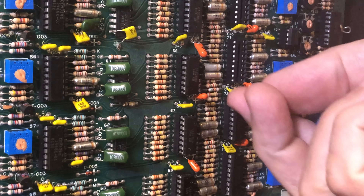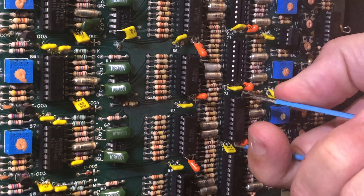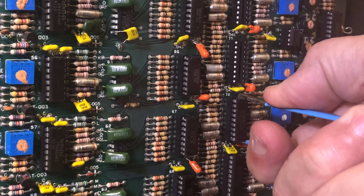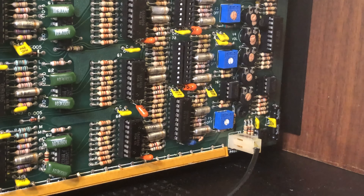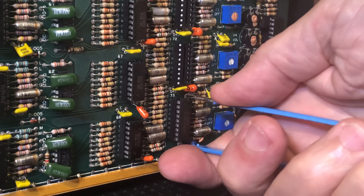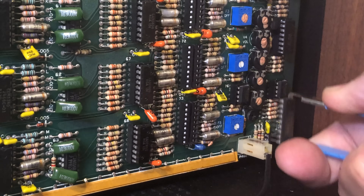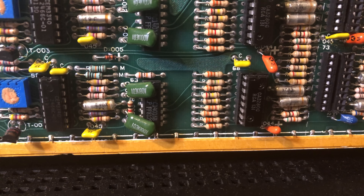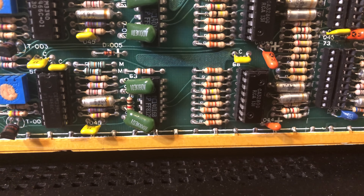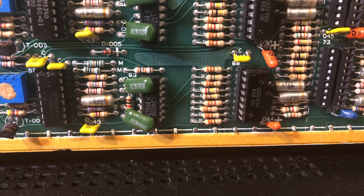You might need to gently bend the yellow capacitors over a bit to make room. The five filter chips are being replaced by the REV-1 kit, but don't throw them out — they're quite rare these days, and they're used in a number of other vintage synthesizers. This straight line of solder points along the bottom edge of the board is the plus and minus 15 volt power rail, and this is where you'll need to solder the one wire to the REV-1 board.